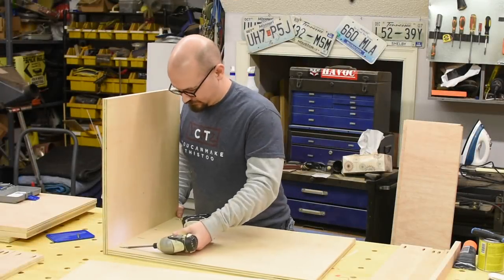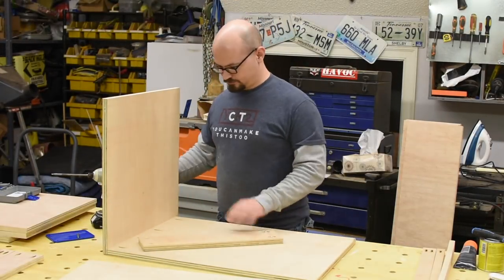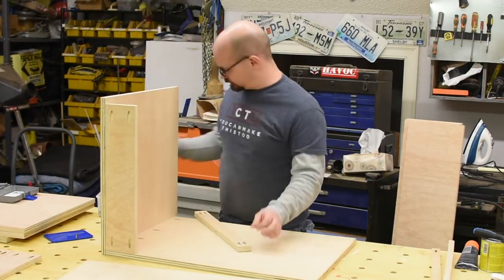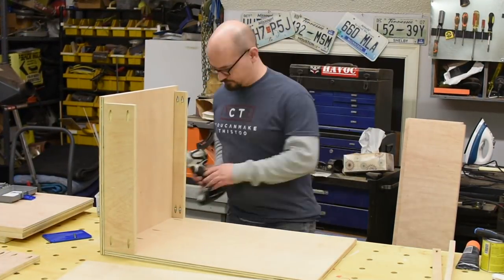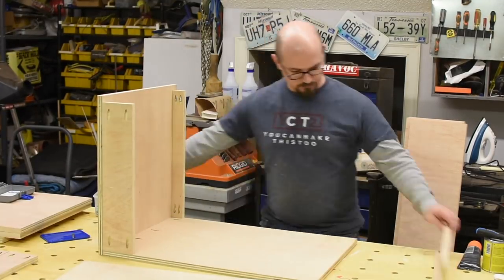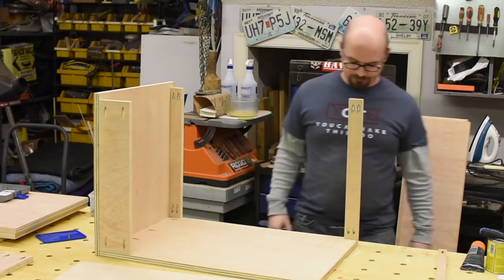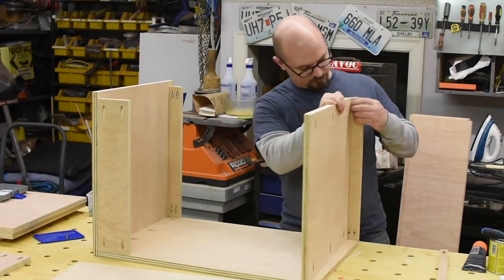With the bed pretty much ready to be installed, I switched to building the cabinets and shelves that will flank the bed. These are my own design. One thing I have learned about building pocket hole cabinets is to pay close attention to which side you put the pocket holes on, so that way they stay hidden. A little bit of forethought will save you having to plug any holes later.